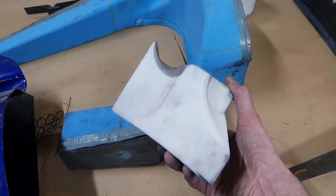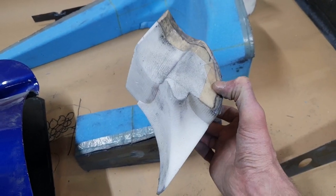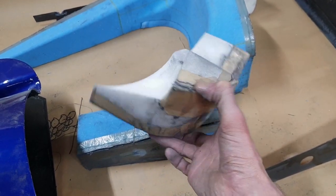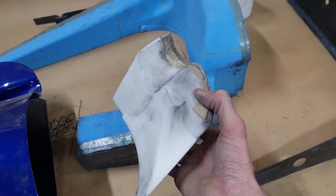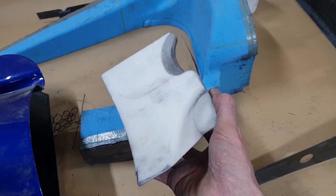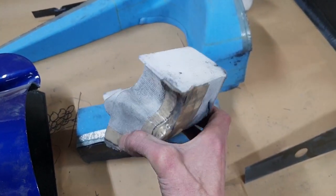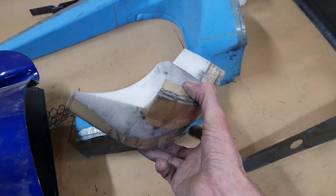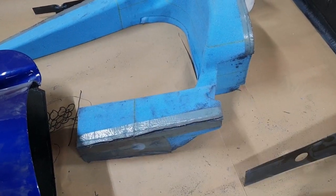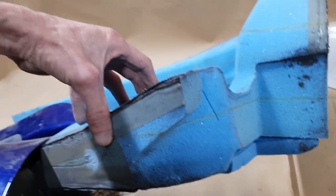If I remove that, you can see the part again bonded up from two 60mm or 70mm thick parts, because this is expensive when you get into thick sheets. And again, open cell, the tape is applied to stop the epoxy bleeding in and changing its properties. So that is that part. I think we have it all nearly covered.